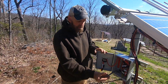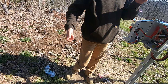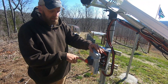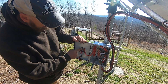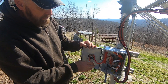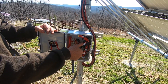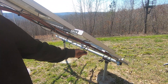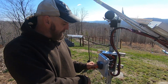Remember me putting the tape around the conduit? Look how much wire I've got left — no waste. I've got a loop here and I'll undo it when I bury it. No waste. Going through the combiner box: this is the marine disconnect switch, I've RTV'd it, and I drilled out the back side — there are the bolts to connect. I'm putting an automotive fuse in — this means everything is protected to this bar. Each panel is now fuse protected, with cables going to each panel. I'll have another switch in the cabin just like this.